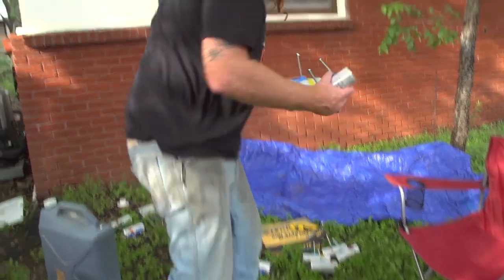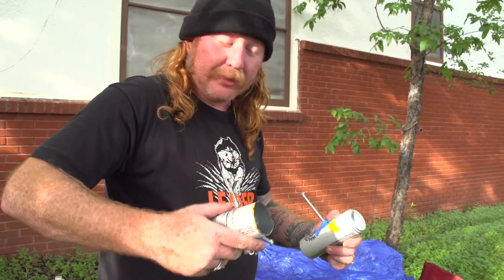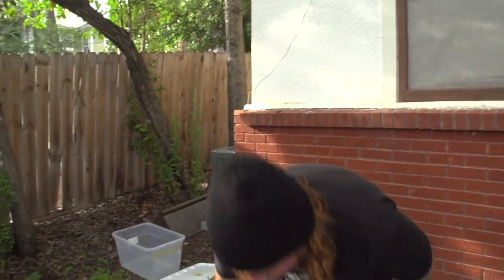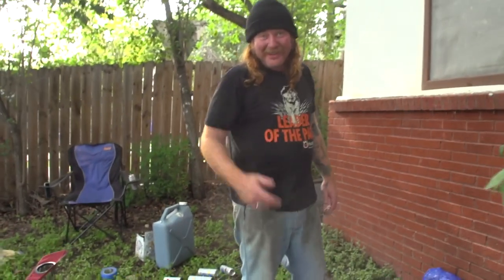Welcome back — we got our cans done and ready to start pouring. We did two different kinds: the more bolts you've got, the stronger it's gonna be when you go to install these. We also did single ones. I've actually just mortared these to obstacles before, but we're doing it legit today. Next we're gonna fill up the cans with concrete. You want about a gallon of water per 60-pound bag — don't go too much or it'll be too runny, too little and it'll dry up on you.